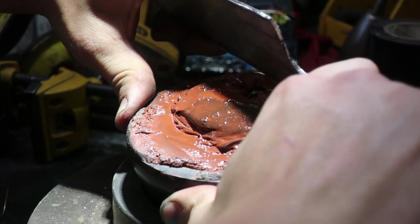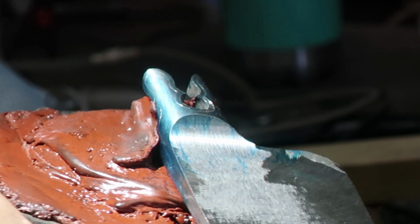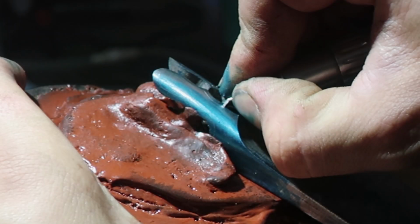There are two different ways that I know people do inlays. The first one's the fire inlay, which is creating grooves in the steel and brazing it to fill in the areas that you cut out. The second way is mechanically fixing it by using a series of undercuts and barbs sticking up, creating dovetails. You start by first undercutting the side of the channel you made. You should actually see the steel move upwards, and then follow up by coining the bottom of the channel, creating a series of barbs going into dovetail formation. The gold will work its way into the groove and anchor itself in there.